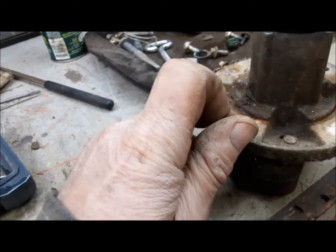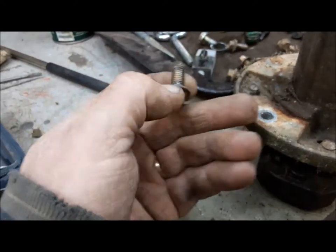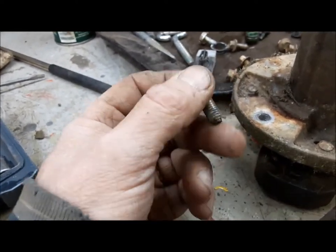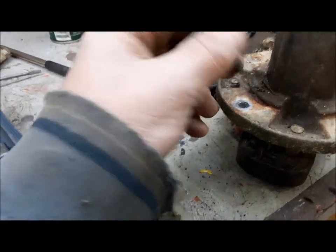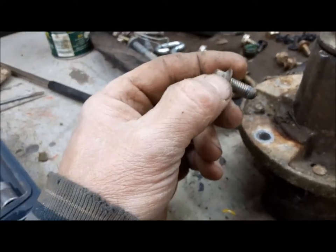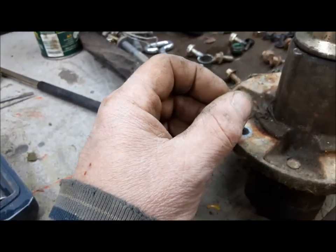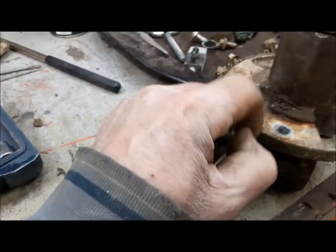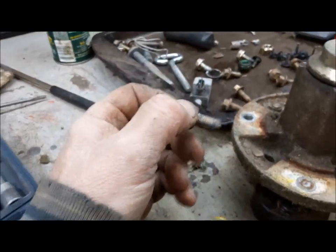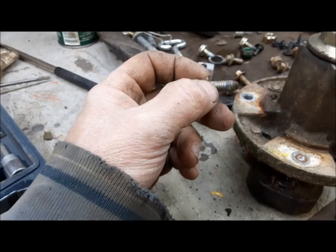The problem with these things is when they're cast, they don't put any threads in the holes. These use a kind of self-threading bolt — I guess they do that so the thing doesn't rattle itself apart in use, but that makes them get just jammed in there. Because these bolts don't really cut the thread as much as they just burrow a thread. I'm going to drill them out and then change them to 5/16ths — that looks pretty close to an M8 — and we'll just make them 5/16ths bolts, much easier.